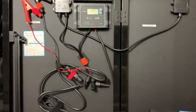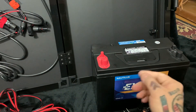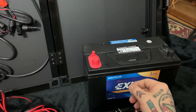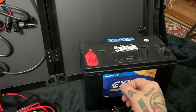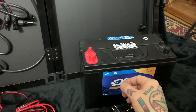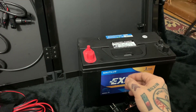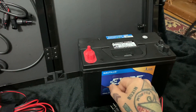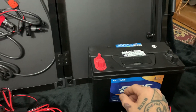I'm upgrading to 200 watts so I can cut the recharge time on this 115 amp-hour battery down to about 8 to 10 hours under ideal conditions — and that's from a full discharge. Most of the time nobody is doing a full discharge unless they're running heavy loads like a refrigerator or a miniature microwave, which typically only draw the battery down to about 40%. So on average you're looking at about six hours of recharge time per day on a 100 amp-hour battery.